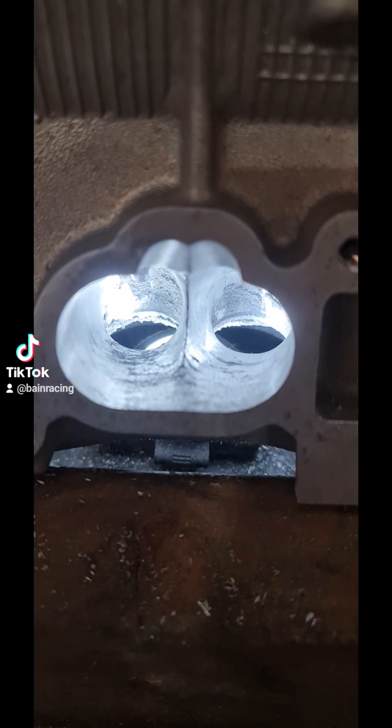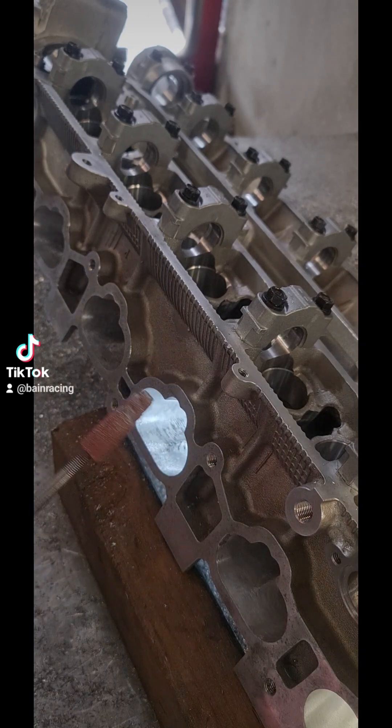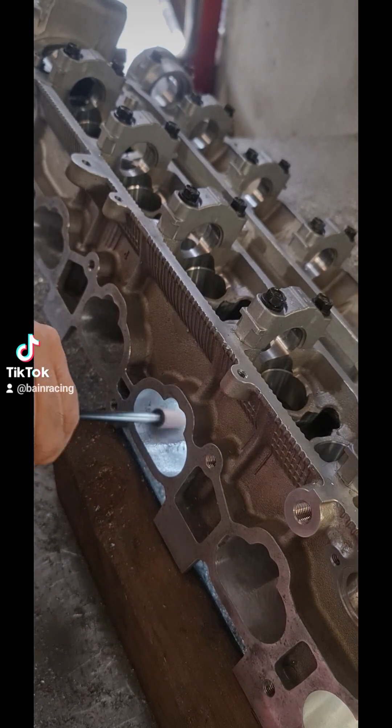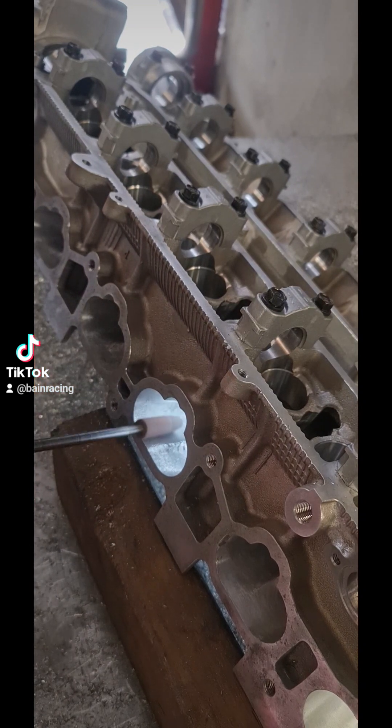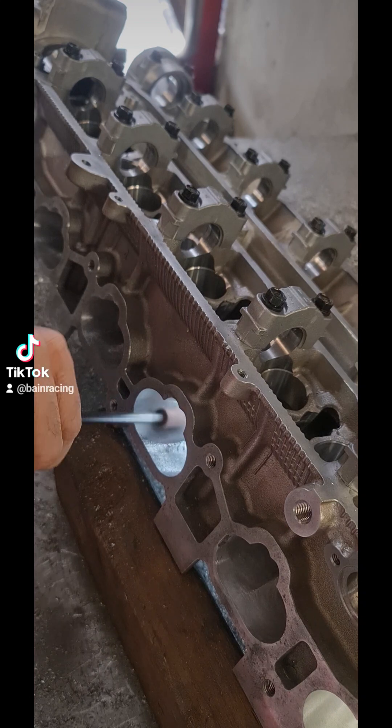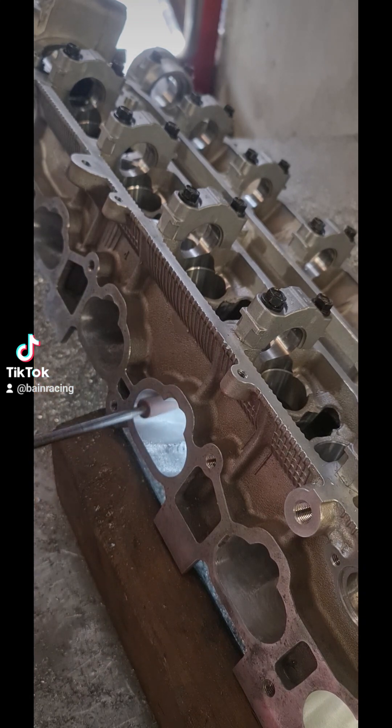I've got to do this one now — I'll show you the procedure. The cartridge roll we're only using at about 11,000 RPM. Just keep it moving nice and quickly; you don't need a lot of pressure. Flutter it around — if there's any ridges or stuff, just flutter over the top of the ridge until it works its way level.